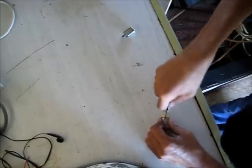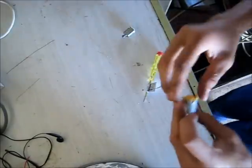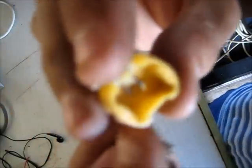If it hasn't got wide enough access to the clips, you can see there how they overlapped and burnt out. Looking at it this way, I can see that they're actually going to touch. You can see there I can get the brushes to touch again. I've got to bend it in a tiny bit more to get that to close the circuit properly. Should just bend that, and they're pretty close together now, and it should work.